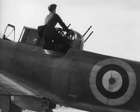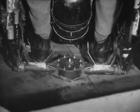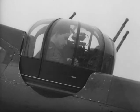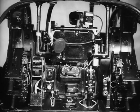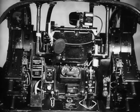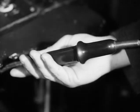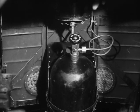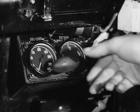The airman then climbs into the turret, grasping the vertical stay tubes to assist himself in. He places his feet on the foot rests and closes the turret doors by operating the ratchet handles. This is the view of the panel from the airman's eye line. Its apparent complexity is simplified by a close-up description of each component and the part it plays in the routine before the airman reports guns okay. He first plugs in the intercom, then connects up the oxygen supply by plugging into the bayonet socket on the left-hand side of the instrument panel, and tests the flow by operating the regulator valve. In order to save oxygen, it should be turned off after testing.